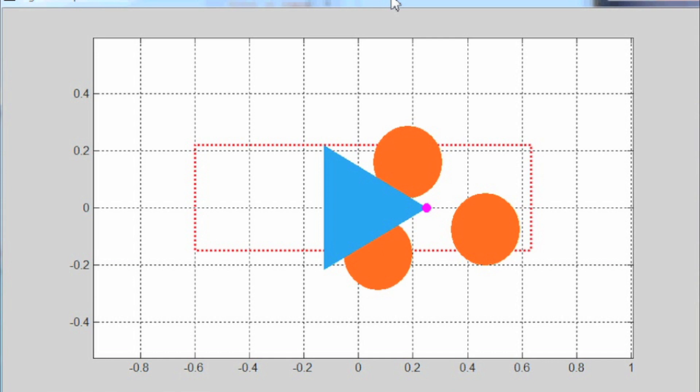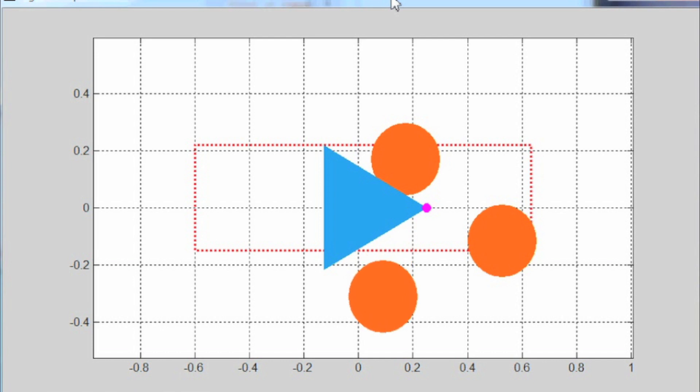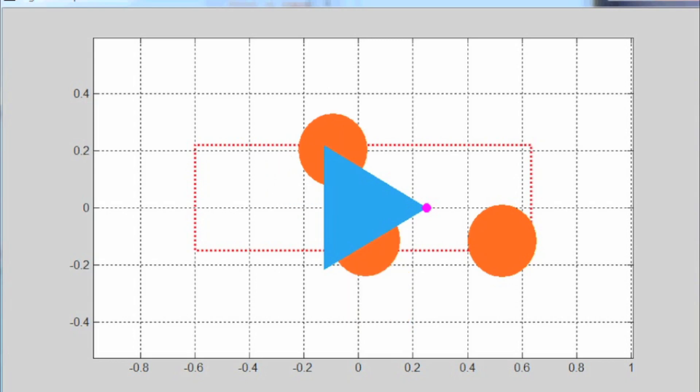Now if we dig into the MATLAB code running — as I move those robots — it's finding them and updating their positions in the MATLAB model. I'm actually moving them a lot more than you see in this picture, and you can see them kind of jump; it doesn't smoothly move as we'd quite hope, and again that's a lighting issue. Ideally, what the robots are going to do if I run the code is form a triangle — at each point of that blue triangle within the workspace. Each robot is identified as unique and given a go-to point based on the triangle. The pink dot you see is where I clicked with my mouse, which instructs the triangle where to draw, so you can have some control over where these robots move. They aren't actually moving here — I'm moving them — you just can't see it.